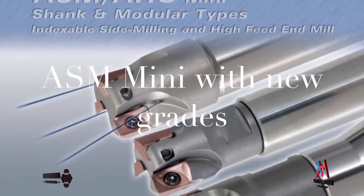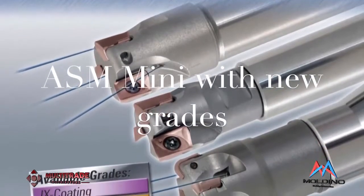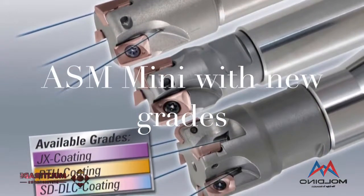We've had excellent results with these, stability wise and metal removal rate wise, as well as in a large amount of cases we actually replace solid carbide cutters with a lot more cost effective way of roughing material. So really a good cutter. Solid carbide end mills.